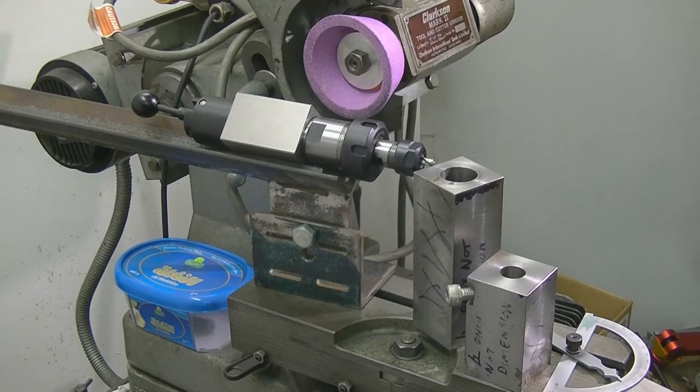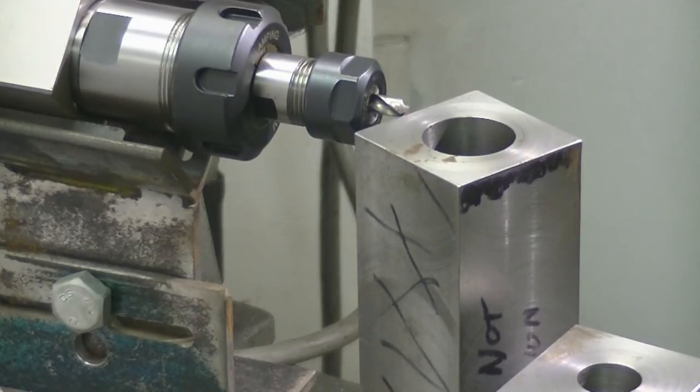It's set up now with a 5C collet block in my big drill grinding attachment, which we'll look at later. One of the hardest things to do is to set the lip of the drill in the horizontal plane so that you don't get wonky facets. I'm using the top of a squaring block that I use for milling slots in locomotive axles — it's a reasonably square item. You could use a cylindrical square off the table to align the drill in the collet chuck so the lip is parallel to the table. Using this method you can get within a degree, even on relatively small drills.